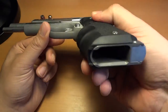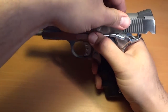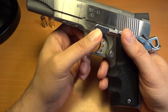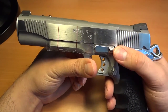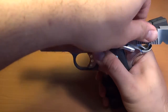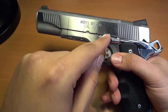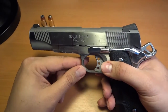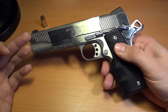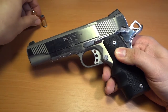The first test I did was no magazine in the gun, and I would drop the slide and let it go forward. The way I would measure that is I placed two lines on the gun. They're 1 inch apart and 1 inch from the end of the slide release. And when they would line up like that, that would be the end of the test. So I would turn the camera on and release the slide, and time how long it took to go from dead stop to dead stop. Now, if having a bullet in the magazine somehow cushions or slows down the slide, then we should be able to measure that. That's a measurable thing that we can do.